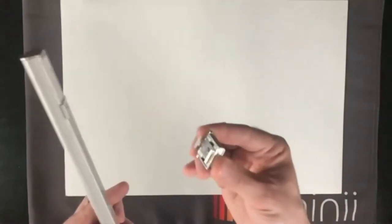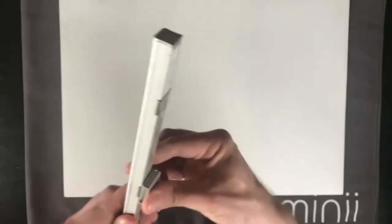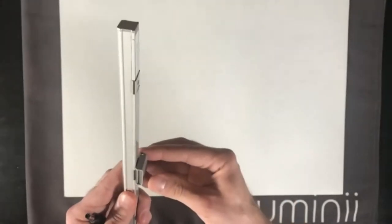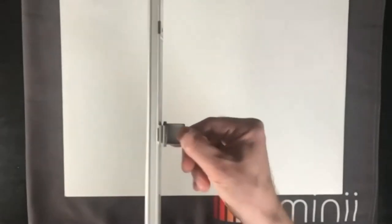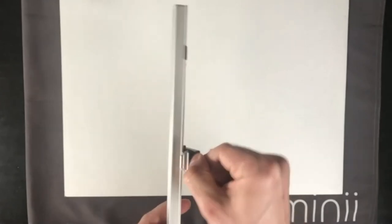And then the last bracket that we redesigned was our adjustable hinge. Here it's more low profile compared to our previous one, which was probably over an inch tall, much bigger than the fixture. Now you have two set screws to lock that in place. So it works really great for grazing, so you're able to lock in that fine adjustment on that fixture. Nice.